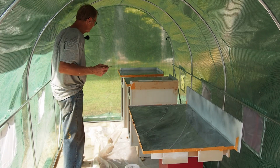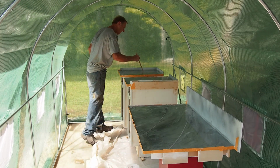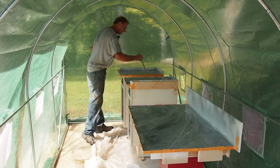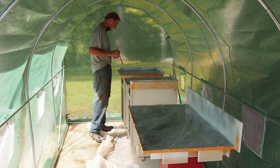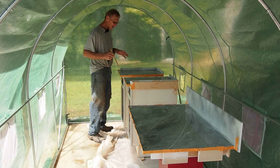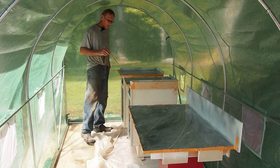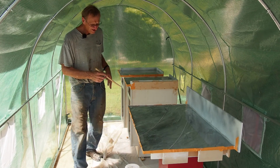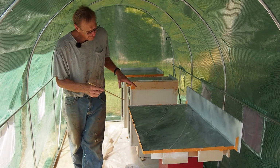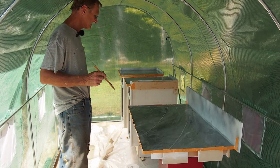So this will sit for about 3 hours out here, and the epoxy will start to harden up some. When it gets to a certain tackiness to it, where it's still liquid but not wanting to flow quickly, I'll remove the tape around the edges, and then this pattern will just wrap over the edges and cover all those rounded edges that we made on these pieces.